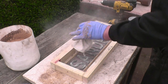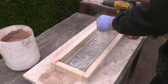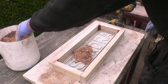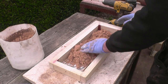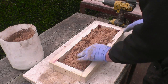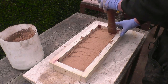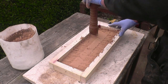Parting powder is dusted across the top of the pattern. This is to stop the sand sticking and hopefully allow the pattern to come out easily. The sand I'm using is actually silica sand — it's a really fine sand that they put between the gaps in block paving. You can see here how it's become nice and fluffy and aerated after being mixed up with the sodium silicate.